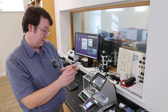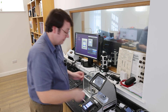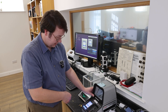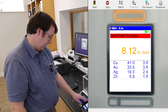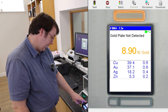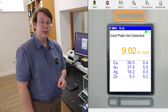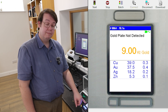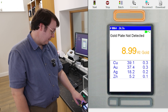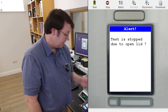So this time for the 9k ring — a bit damaged, looks like pliers were used to remove it. We'll put it on — I'll try and stand it up to get the best flat surface contact. And it is coming out as: gold plate not detected, always good; 8.9k gold, which is 37.4%, with a half percent variation. That's absolutely fine — that could go up to 9k gold. So 39% copper, 37% gold, 18% silver, and 5% zinc. I'd be perfectly happy with this. That's a 9k ring.